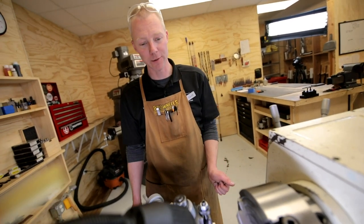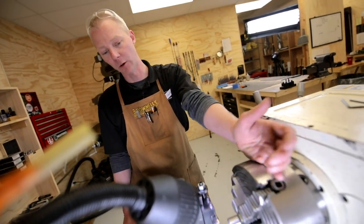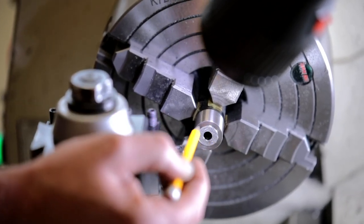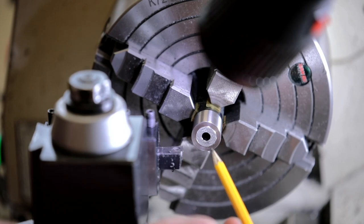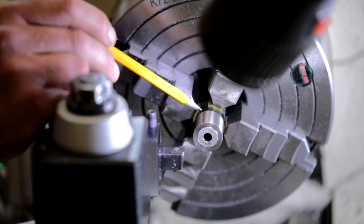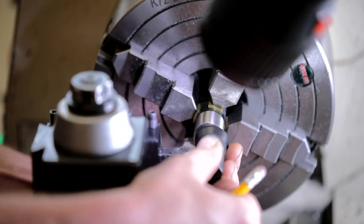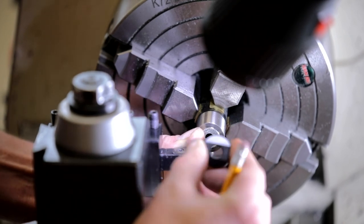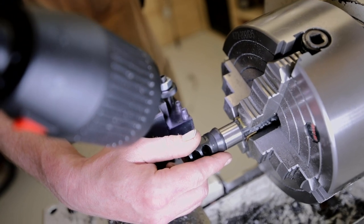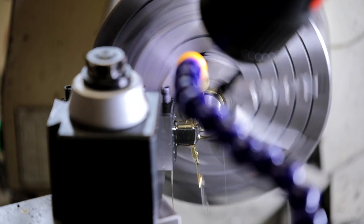We're ready to make some cuts. The first step is cutting what's called a flat crown. Since it's going under a muzzle device, I feel like a flat crown is perfectly fine. There will be a 60-degree chamfer right there where the bullet exits the muzzle. After that, I'll be turning the major diameter for the threads — in this case it's going to be 5/8-24. Then cutting the threads and indexing the brake so that the top is on top, in line with the top dead center of the entire rifle.